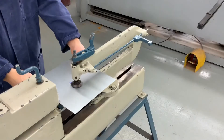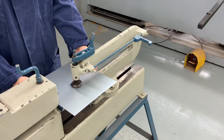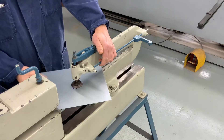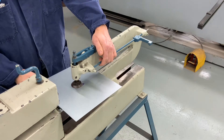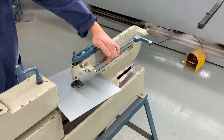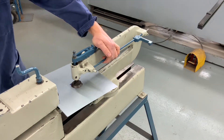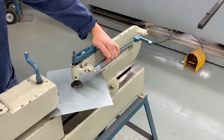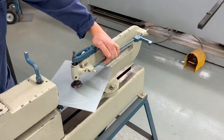Using the ring and circle shear I am cutting the bottom disc. I have set the circle shear to eight and seven eighths. If you are using the ring and circle shear properly it will probably take around three to four revolutions to cut through the metal.